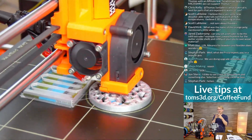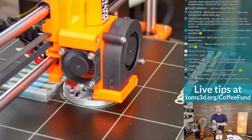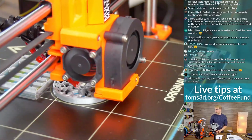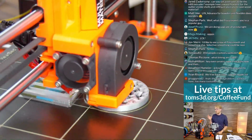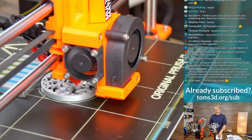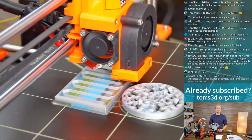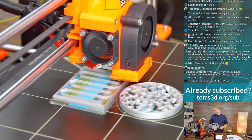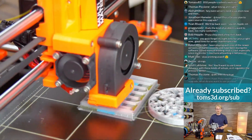However, if you print that with too much shell thickness, or too much infill, it is going to start feeling like a regular rigid material. What might be a bit of an issue is the very soft materials like Filaflex or other super flexibles. Those are probably going to pose a bit of an issue with this sort of setup. But yeah, it should work with reasonable flexible materials.